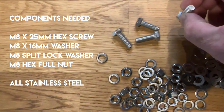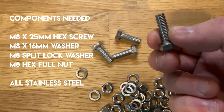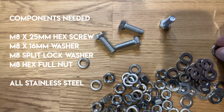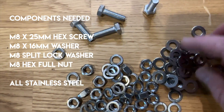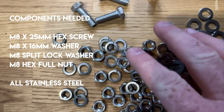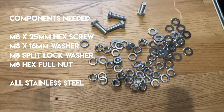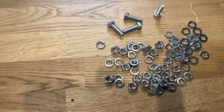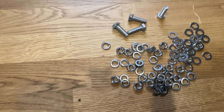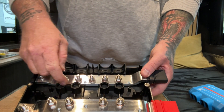What you're now left with is the open unit with your positive and negative bus bars exposed, and four slots underneath which will allow you to add screws and fixings for mega fuses. To do this you're going to need M8 stainless steel 25mm bolts, 16mm M8 washers, and M8 nuts — all stainless steel. I'll leave all the links in the description below. You're going to need four sets of all these components to accomplish the conversion.